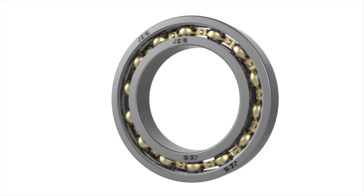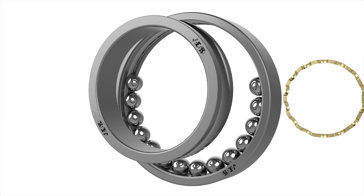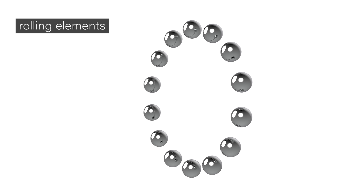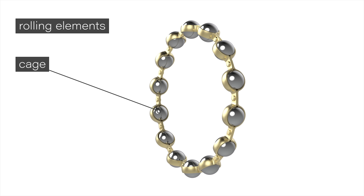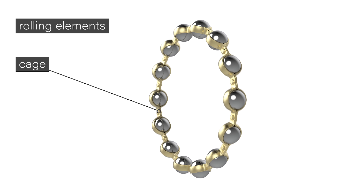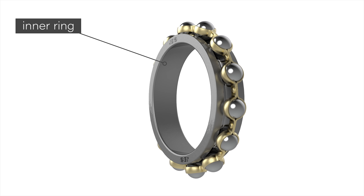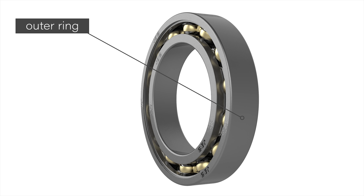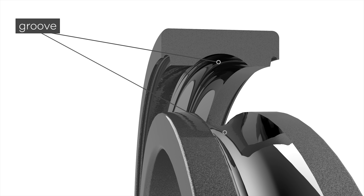Let's take a closer look at a classic ball bearing by decomposing and sectioning it so its components can be analyzed. The first elements that immediately get our attention are the steel balls — they represent the rolling elements and they are held together by a cage, which can come in different shapes and is made of low friction materials. Then we have the inner ring, usually the one that moves, and the outer ring, both with a groove which can be more or less deep in order to make the rotary elements glide.